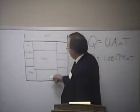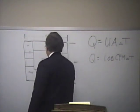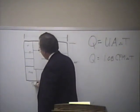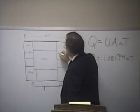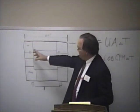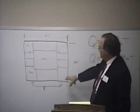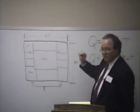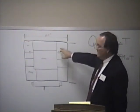If you take this ductwork and split it, and this has to be done in design, you can put a control box, and now you can give control to the air so that each side of the building can receive the amount of cool air or warm air that's needed for the particular instance. And that's a simple example. But instead of having one side hot and one side cold, it allows the air to be controlled to the point that the exact cooling requirement for this office can be met at the same time that this one's met.